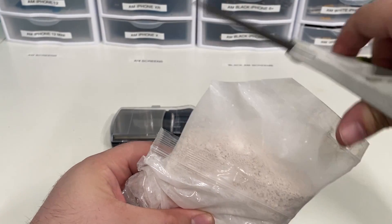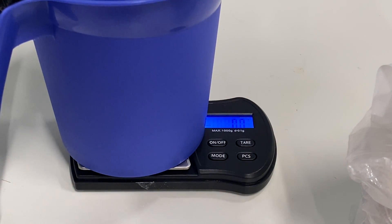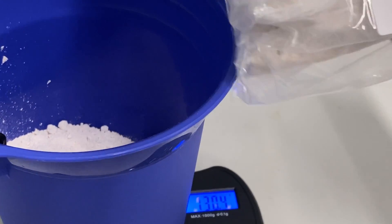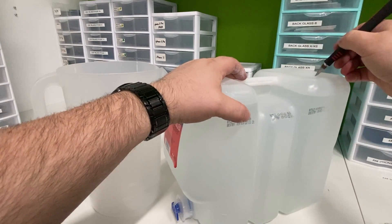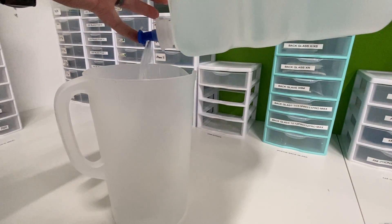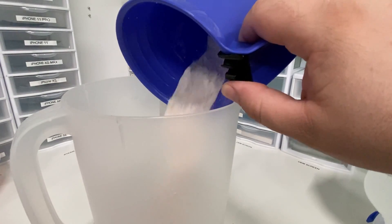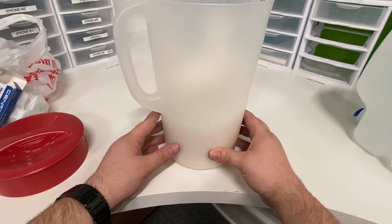This here is a glass polish known as Cerium Oxide. We're going to be adding approximately 67 grams of powder for every liter of water that we add. I'm using distilled water here, although it's not necessary. We will pour in the Cerium Oxide powder into the water and mix it thoroughly. The method I use is simply pouring it back and forth multiple times between two pitchers.